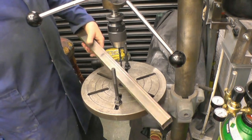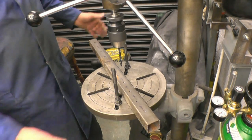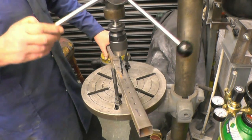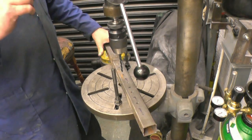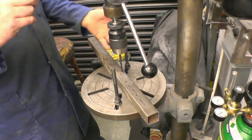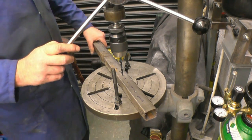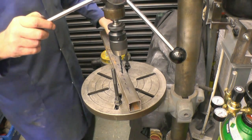I'm just going to drill the holes in here with this little drill press. I'm not going to clamp the workpiece, I'm just going to hold it by hand. I've got a couple of pins in there which will actually stop the job twisting, if that's long enough for me to hold. The belt would slip on the drill and the drill would snap - you don't go holding it like that, you're going to hurt yourself. Keep your hand well away from it and you'll have no problems. If you want to clamp it, clamp it.